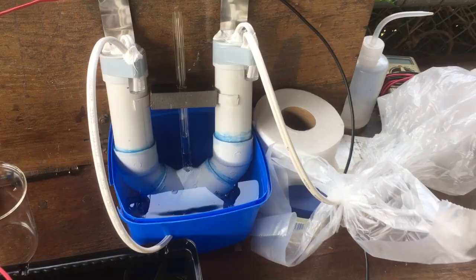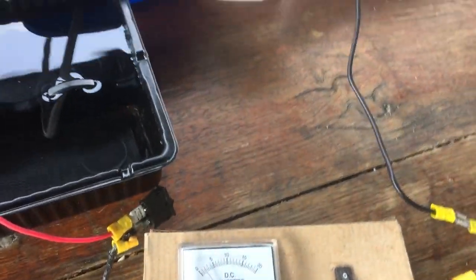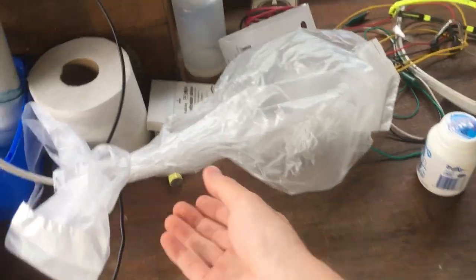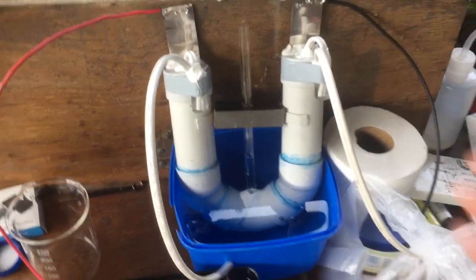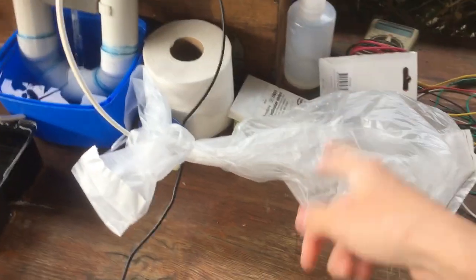It's been about five hours since we started electrolysis. Everything is going well, but the sun has nearly set — about an hour or so until it's gone. The current has tapered off, we're still getting around four amps or so. The amount of hydrogen in the bag is not too bad — there's a fair bit there — but I was expecting a little bit more, especially at four amps. I think that's probably because the plastic bag I'm using leaks hydrogen quite a bit. While it was successful in the fact that we can leave the cell running at five amps for six hours or so, I think we'll try again tomorrow and maybe set up the solar panel a little bit earlier in the day to get a whole bunch more hydrogen generated.